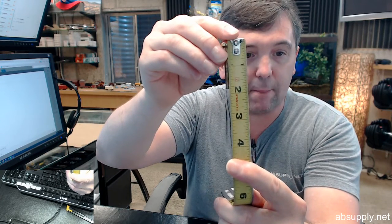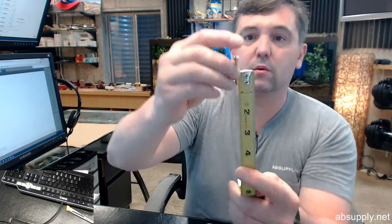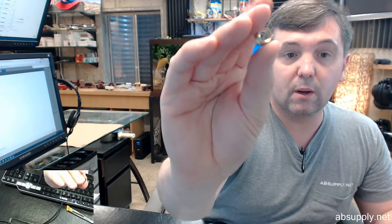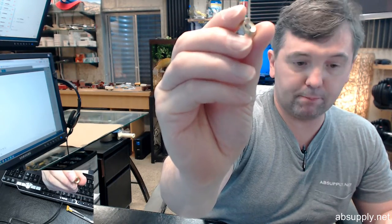Overall, with the top of the head, it's about 1 inch and 13/16. You've got that oval head screw. It's going to be about 1 1/8 inches in length from the underside of the head. And then again, probably this is going to be a number 6 brass finish washer, or countersunk washer, we would call that.